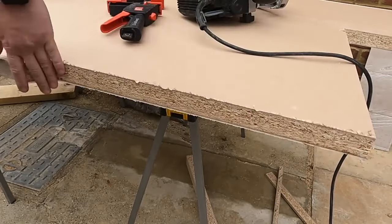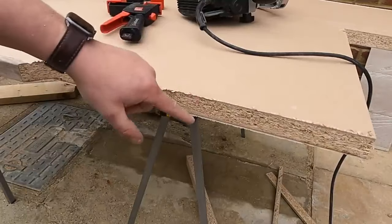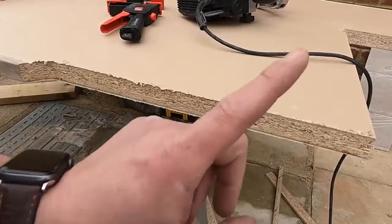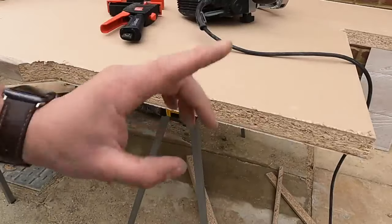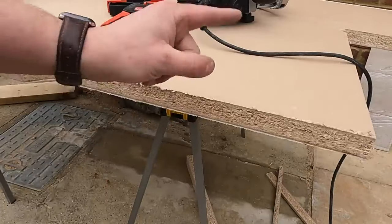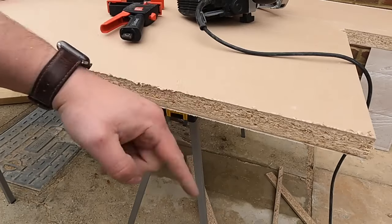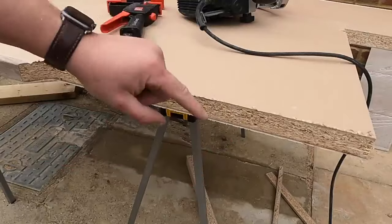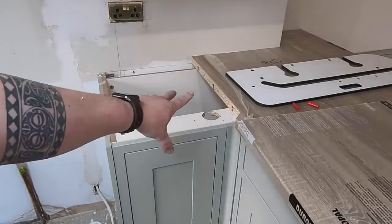There you can see we've got a lovely clean cut - no lumpy bits in there at all. I would normally now do the worktop bolts - I've done a whole video on how to do those bolts, I'll link it up and in the description. Now we're going to take this back in and turn our attention to doing the male part of the worktop that joins up with this.